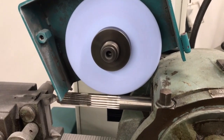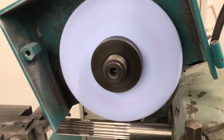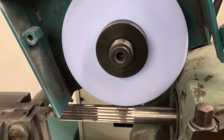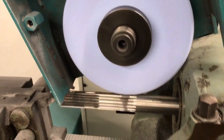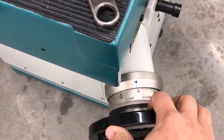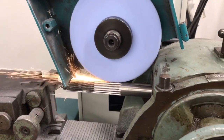Where I'm at now: I've done some rough dressing and some crush dressing on this. I'm going around making a roughing pass, trying to remove a lot of the bulk material here to make it a little bit easier. I've tried several ways to do it and ultimately decided on something a little different from what I would have solved instantly. I'm going to bring it down to a touch on the top of this right here, and once I touch there, I know where my zero is. Then I'll go around and feed it down to my next zero.